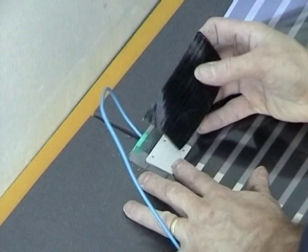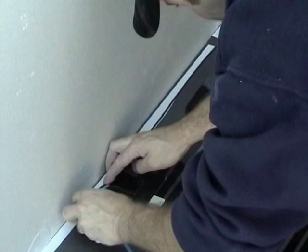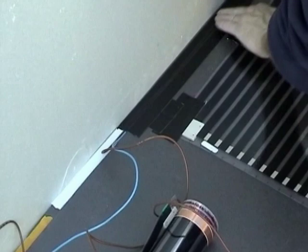Take care to keep this neat and do not remove too much insulation material. Secure the wiring from the cold tail joints down in the 50mm gap between the wall and the insulation. You can apply duct tape over the top of the wiring as well to ensure it's secure. Repeat the same process for the rest of the elements, ensuring that the wiring is tidy.